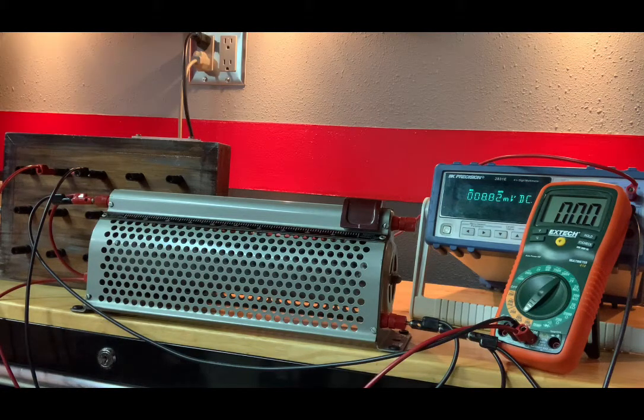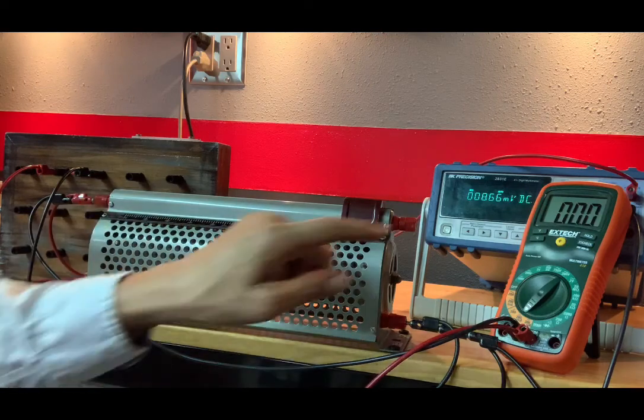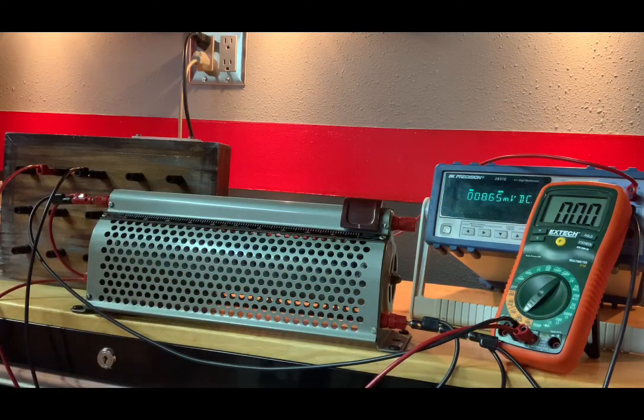So table 9, and we'll go over the errors after we take the data. Rheostat position, again, this is in units of percentage. So I am at 0%. My output voltage is 0.00870 volts. It's reading millivolts, but we'll convert it to volts. And our current is zero current.